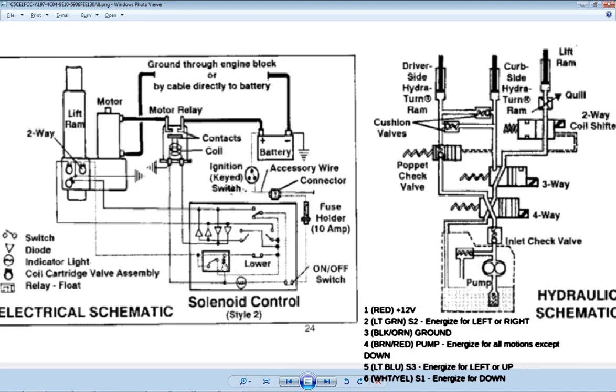The float relay is nothing magical. It's a standard SPST relay wired in a latching configuration, so that when the coil is energized, the switch also keeps the coil energized. When you push the lower button — which is drawn bass-ackwards in this diagram — you've got 12 volts energizing the coil of this relay, which is connected to ground. The relay then connects 12 volts through its contacts also back to the switch, bypassing the lower button and holding it on. Since the lower button is on, that holds the coil of the relay on — so the relay is latched on and keeps it in lower mode.